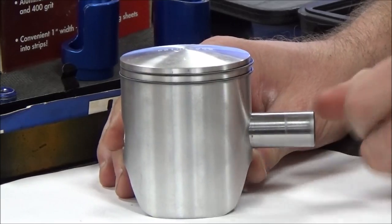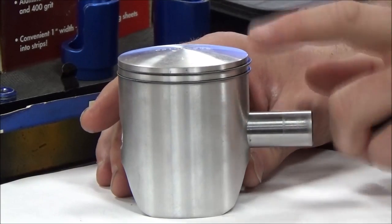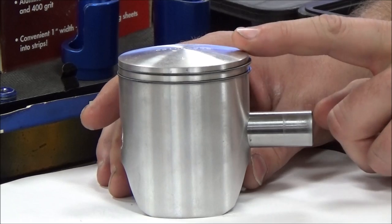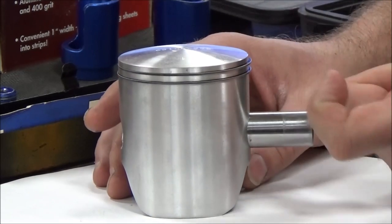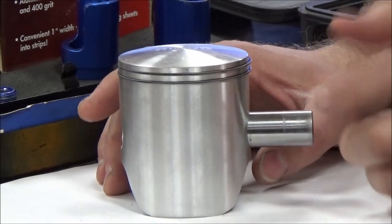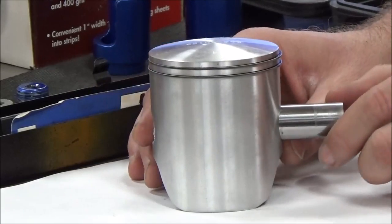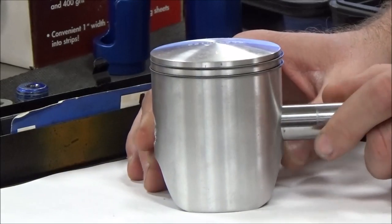This is as far as I can get that pin to go in, but it goes in really smooth to there and then hits something wrong. You have to figure this is still mass-produced — could there be a piece of machining metal sticking up and blocking things? These mass-produced parts are so well built that we typically don't have to mess with it, but sometimes you do have this happen.